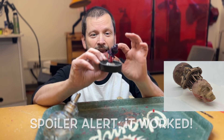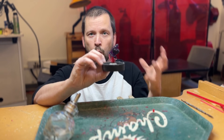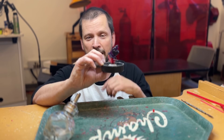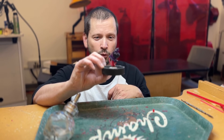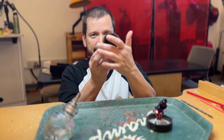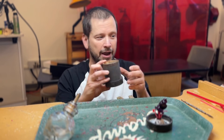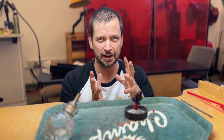With a more involved sprue system, it would be ideal — though tricky — to cut it off your flask base and weigh it to get a more precise idea of how much metal you'll need. Be careful: you can attach all of your other sprues to the main sprue rod to make removal easier. Also consider placement in the flask — having the piece centered with plenty of investment coverage at the top so the metal won't break out, and nothing too close to the walls.